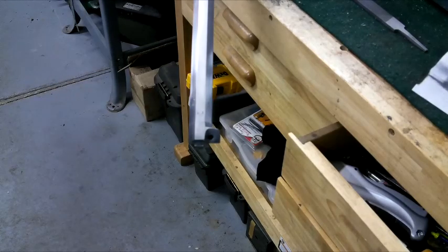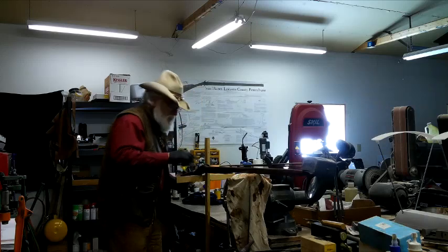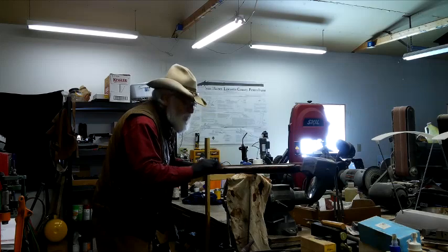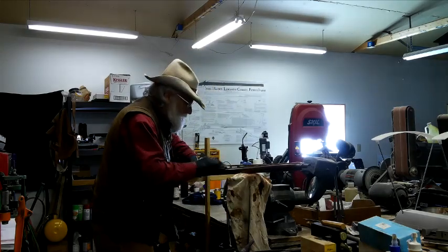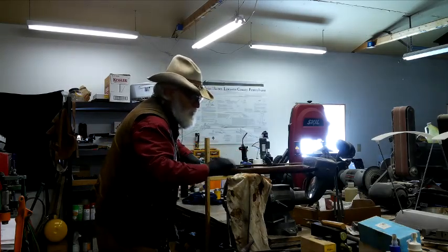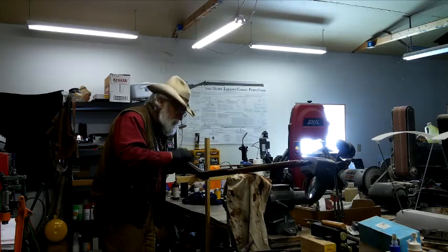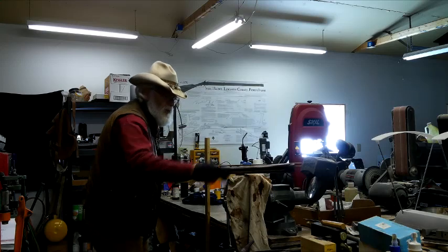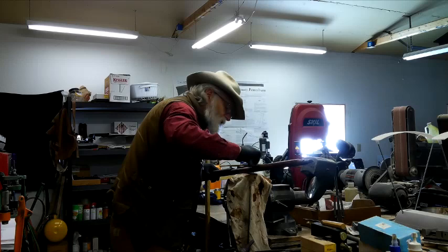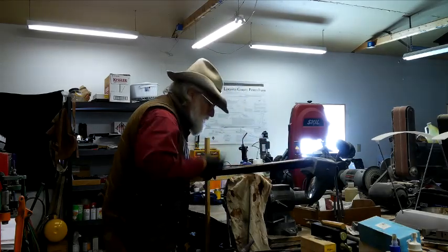For this first rubbing I'm using steel wool mainly because I want to work that sealer down a little bit so the oil starts working into the wood past the sealer. After that I think I'll buff it with a wool — regular lambskin wool pipe. You've got to make sure this thing is cured before you start rubbing it with steel wool. This one is very well cured — it's been overnight in a warm shop. I can tell it's cured good because when I blow, all the little bits of steel wool blow right out.